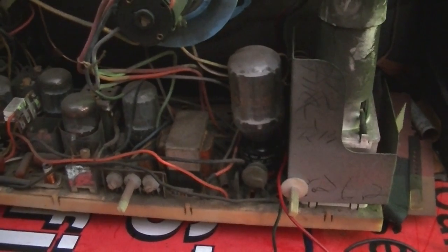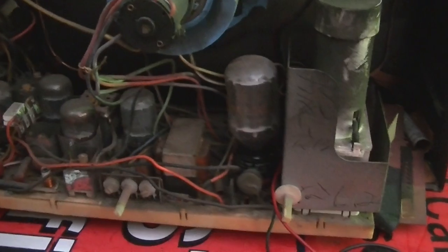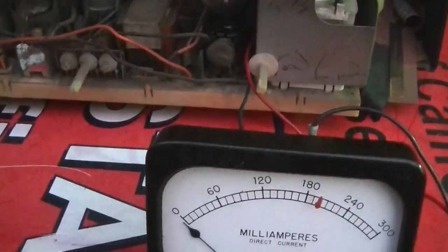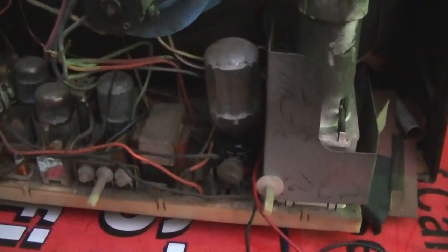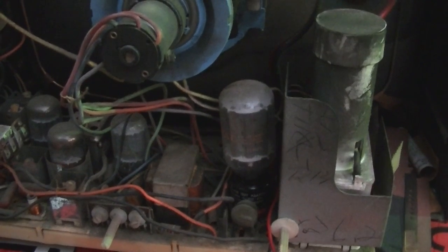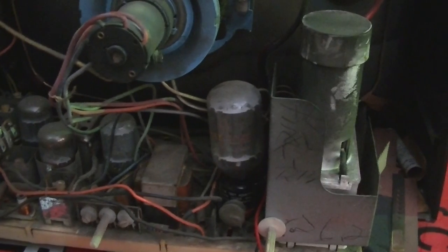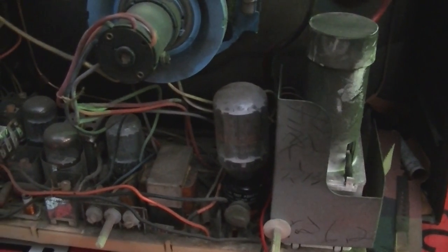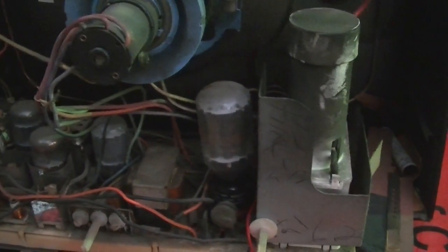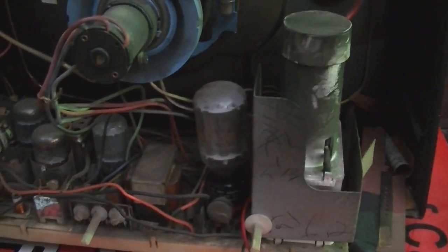This looks like this is going to be a really good in-depth diagnostic video. I don't even see how that tube is conducting that much current. I thought that tube, even if it had no G1 drive to it, if the oscillator wasn't running, I didn't even think it would shove 300 milliamps through it. That's almost like something shorted in the flyback to ground. That's an excessive amount of current.